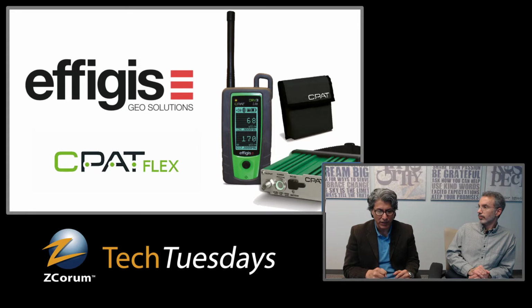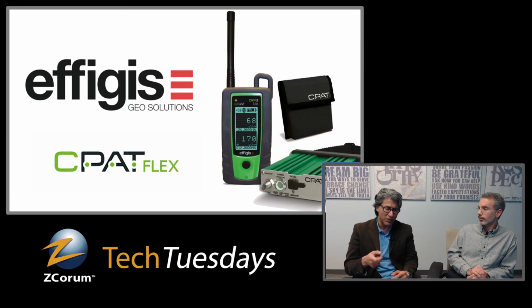Once they find a place that is essentially audibly screaming, then they will make a repair. Maybe it's underground, maybe it's at a connector. From there, do the repair, the update, replace the connector, and then move down the line. What that means is that maybe at this point, you go back to the pressurizer where you once connected it, go a little bit closer to the house and connect it to that point until you've exhausted everything that's happened on the outside.